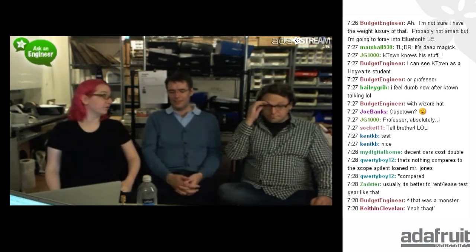This model goes up to 4 gigahertz. They have a 6 gigahertz one, but it's not that useful to me. For most people, they don't usually go beyond 2.4. Most people are doing stuff with Wi-Fi, Bluetooth, and sub 1 gigahertz, like 434, 915. That's what commercial and manufacturing use. If you're military, of course, you have full ranges that they use, but for commercial use, there's only certain frequencies that are most common.